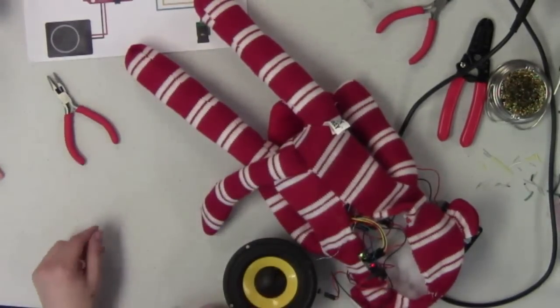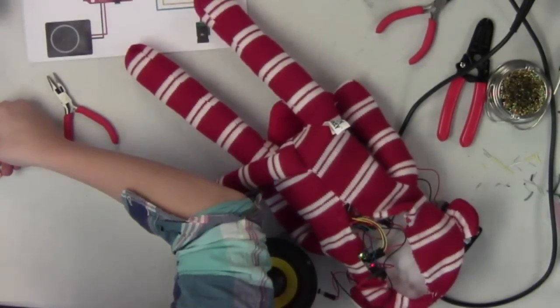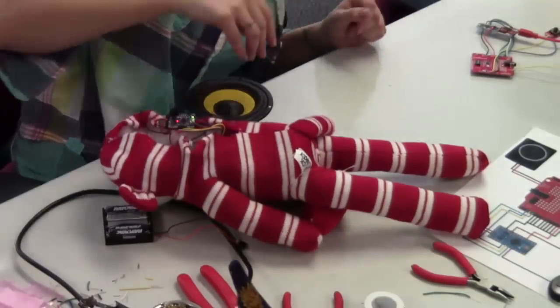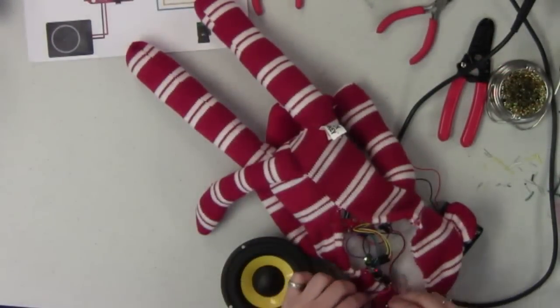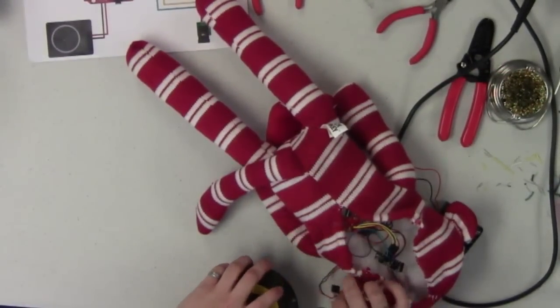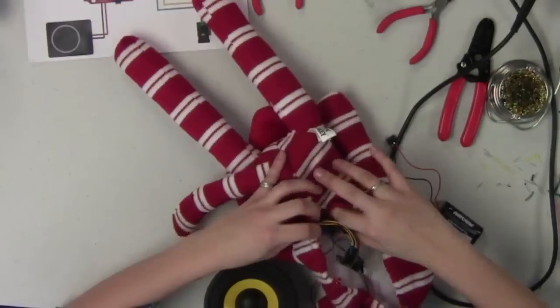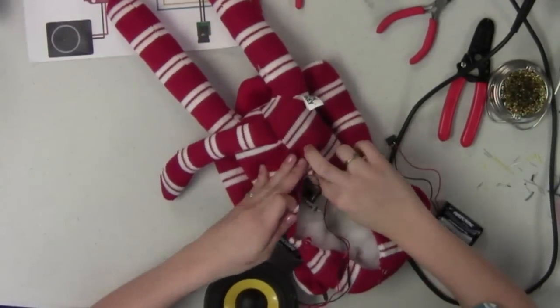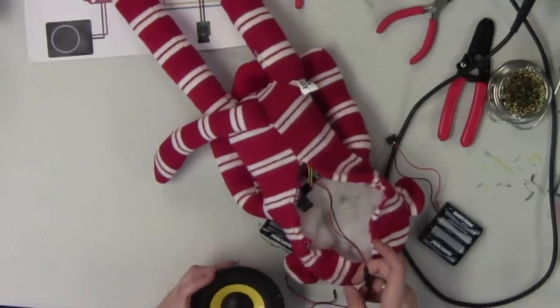All right. So now that we have everything hooked up, we've got it connected up to our computer here. We'll go into the tools menu as we normally do for selecting an Arduino sketch, and we will select the board type, which in our case is an Arduino Pro/Pro Mini 5-volt 16 megahertz with Atmega 328. And we're going to select the serial port that it's connected to. In my case, it's COM38, but yours, of course, is going to be different. And hit upload.